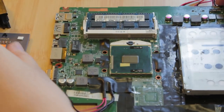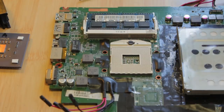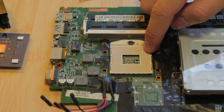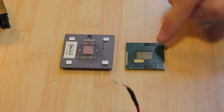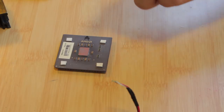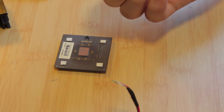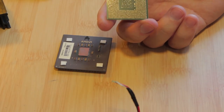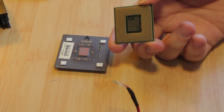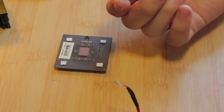So first of all, yes, laptop processors are upgradable. I could plug in a, what generation is this? Like a Sandy Bridge Intel processor, really. All laptop processors are like this, no heat spreader. It's not common for people to even pick up the laptop's mobile processor. This is really not a thing normally. People would often say, oh, laptop means it's not an upgradable processor, it's soldered in. Not always the case. Look it up. Sometimes it's socketed in, sometimes it's not.